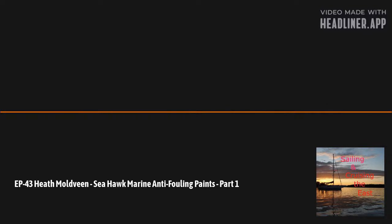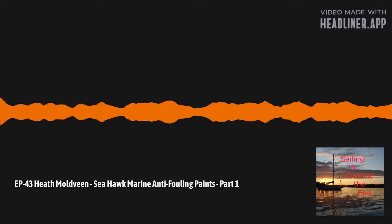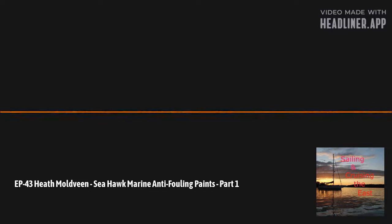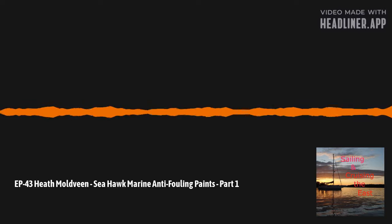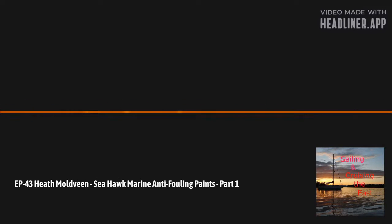Now, there's a middle of the road there by going to a high-performance ablative product like BioCop, for example, where you've done the wet sanding process, but you are using more of a self-polishing paint. Why? Now maybe you don't have to polish, you don't have to clean your bottom every time you race. It may not have any slime on it, so you go racing. And in most cases, you won't have any of that going on. The product works really, really well. But again, racing paints are kind of not new, but another echelon of product to talk about.